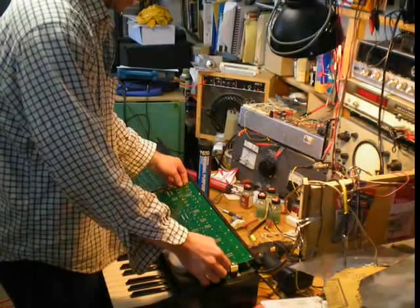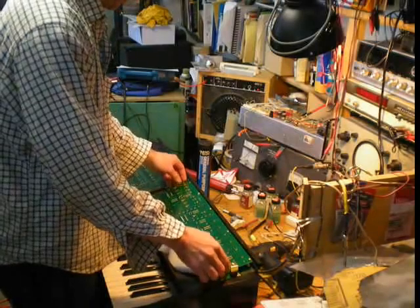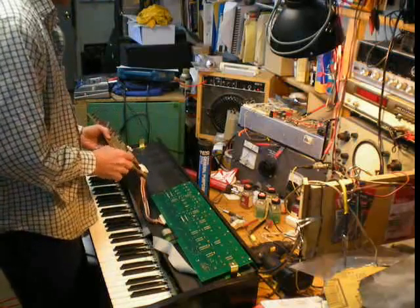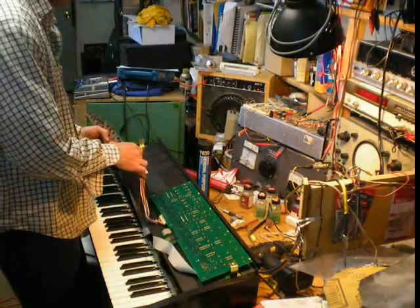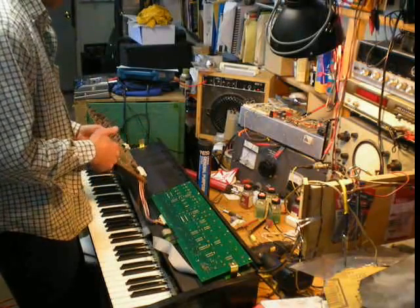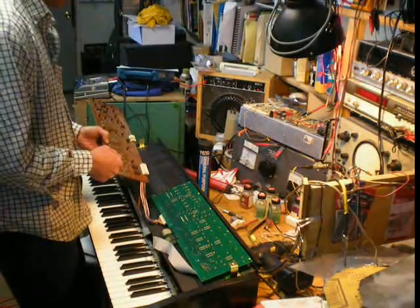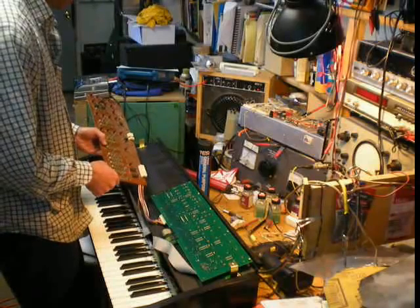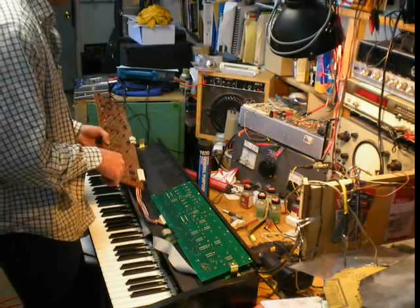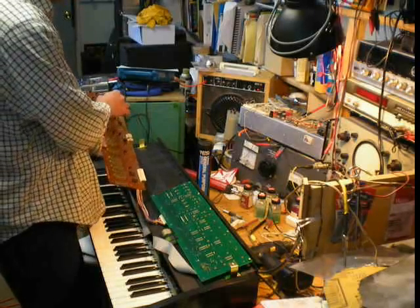We are looking at, I just pulled the boards off here. I did a couple of potentiometers, straightened these out and checked, pulled apart the ones that were bent. And the buttons on these are really rugged. None of them cracked. They're in really good shape. I tested them with a meter and everything's perfectly smooth after greasing them up. And so I think those are all fine now.